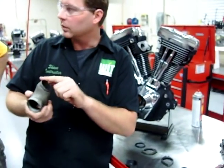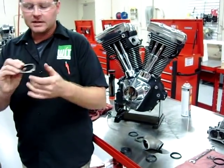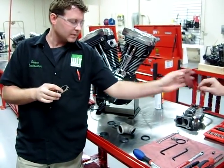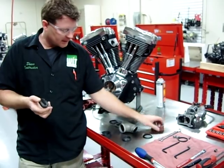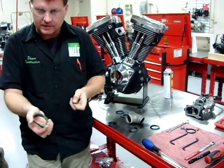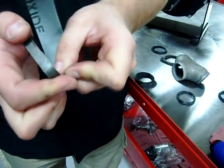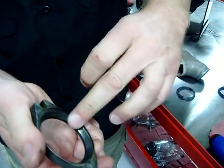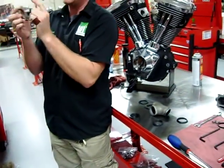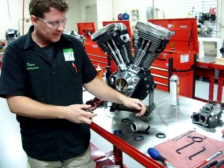While he's grabbing a piece of emery cloth, what you're going to see that we would do is we'd want to make sure and dress this up, get this good and clean. What we're removing is the old rubber off of here — that's a big problem. The other problem that we typically have is these flanges are also labeled front and rear, and I've seen people try to mix those up, which can be a problem. We want to get in here and clean this up. You can see how much buildup there is from the old rubber material. I'm not trying to remove metal, but I'm getting it back down to a nice surface so that as I put the new seal on, the old rubber doesn't create a high spot and cause a leak.